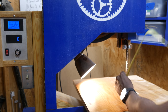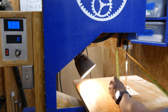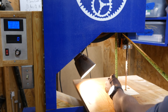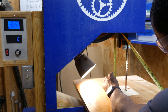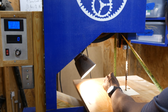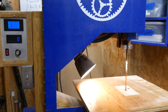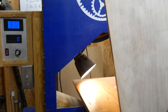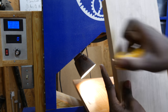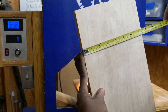We're ready to do some cutting. When the blade guide is all the way up we're at 8 inches or about 20 centimeters. If I remove the guard I get a little over an inch in additional height, and if you remove the blade guide and everything it's 9 and 3/4 inches or almost 25 centimeters. First up is a nice hard board of maple — this is a 1 by 8, so 7 and a quarter inches wide. Let's give it a shot.